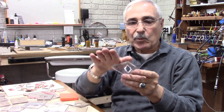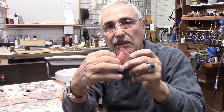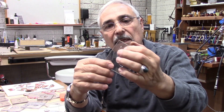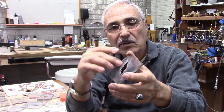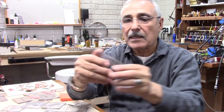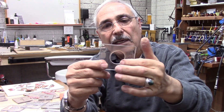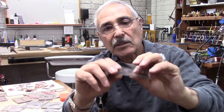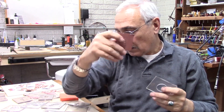One thing you've got to watch: when you press your metal in, you can't have sharp corners. So after you cut the die, you get sharp edges all around. Take a small file or sandpaper and go in and round the edges all around. I'll take a simple round one and sand the radius around to make it nice and smooth. You can do it on both sides so it won't damage the pattern you're pressing.